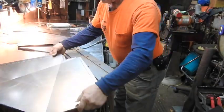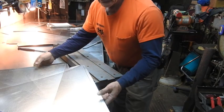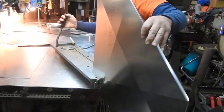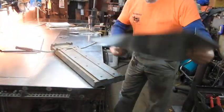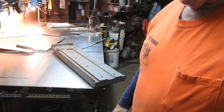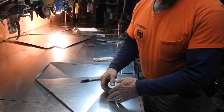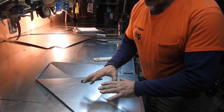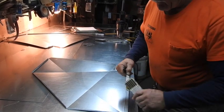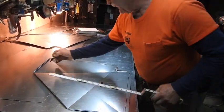This little 4-inch throat right here is perfect for this little cleat bender. You can use a cleat bender with fittings up to 24 inches inside throat — you just slide that in there. Now we're ready for the heel wrapper and toe wrapper. Remember, make sure you use the portion that you laid out to actually make your measurements off of, because the measurements change — they crawl a little bit by the time you use this as a pattern to transfer to another sheet of metal. We remember it was 11 inches, so we know this is going to be 11 inches, but you can double-check just to make sure. This should be 11 inches as well.